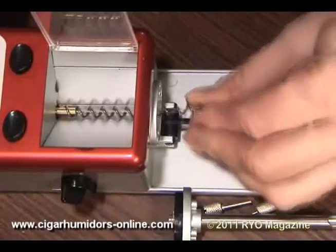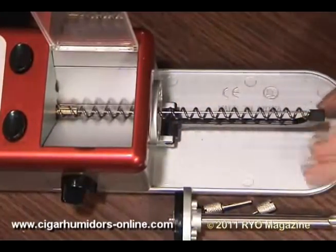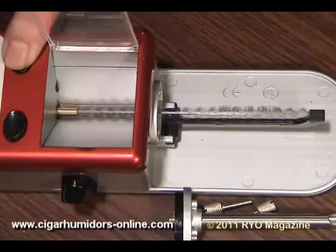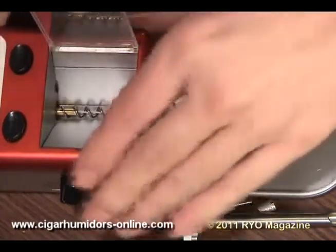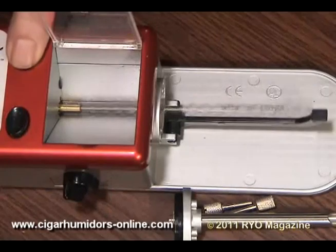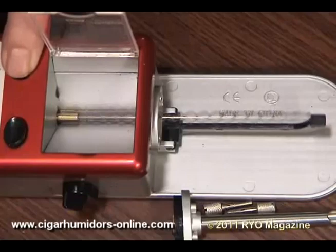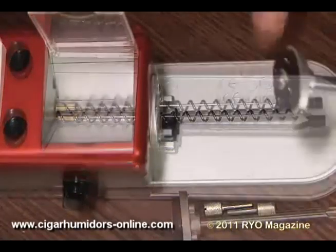The auger slips back on really easily. There's a little hole in the back of the tobacco chamber that the pin in the auger fits right into. Now we're going to run the whole assembly with the auger going — this is at slow speed. See how stable that auger looks? It stays in an almost perfectly straight line. When we turn up the speed, watch how wildly the auger fluctuates. This is what causes the tobacco to be degraded and broken up and eventually causes a less stable stick.